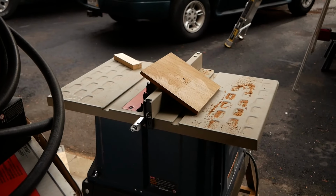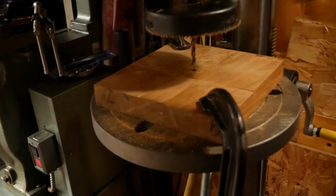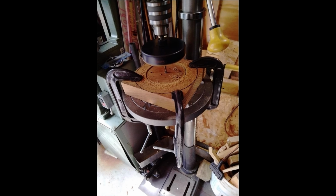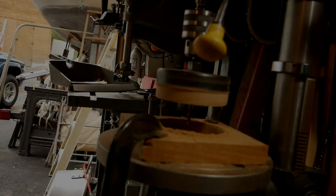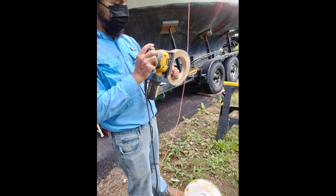I ordered a piece of teak stock, which, because of its thickness, we had to cut down in size for the collar that we'll build, going around the pipe and exiting up through the headliner at the cabin top, and then another piece that will be the base for the Charlie Noble up there on deck. We rounded off 3 of the sides, leaving the squarish side to butt up against the bulkhead behind the stove, or where the stovepipe will be. And for the base up on deck, we'll make it a round donut all round.